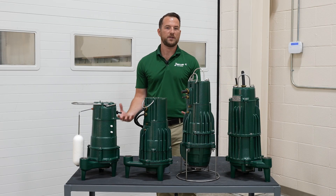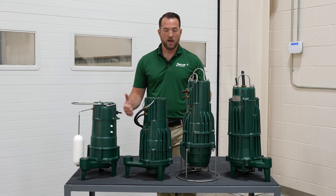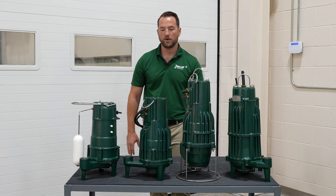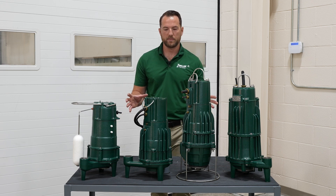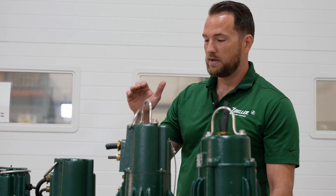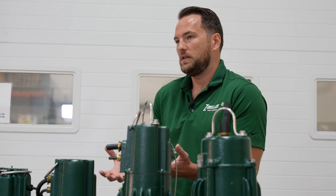This particular pump also has a finned housing. The advantage of the fins is the elimination of heat — it creates convection and pulls heat away from the pump. All the pumps on display have oil-filled motors and solid cast iron bodies, which are great methods to keep a pump running cool. The fins are an added feature that helps keep it running even cooler, allowing us to transition more into commercial applications which are more demanding and can have higher heat buildup. This pump also offers higher pressures and higher flows.